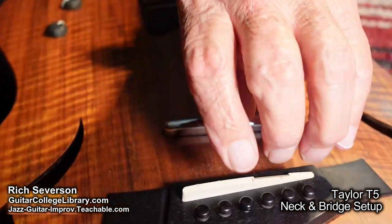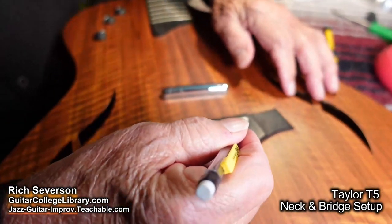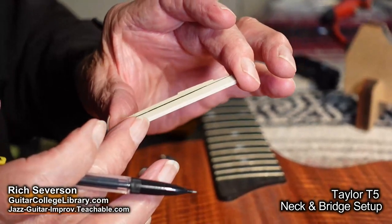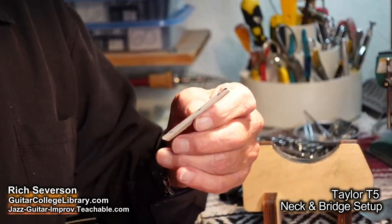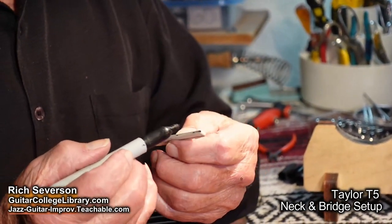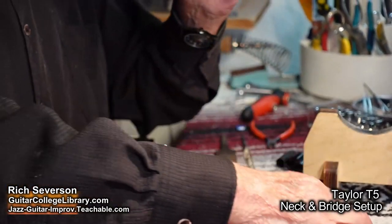So how do we do that? Very carefully, I must add. What we're going to do is we're going to find out where that — we're going to make a mark on the saddle where it's out there. So we can see that and we're going to shave off some stuff here. It was mainly high on this side. We're not going to shave this side — don't mess with that, just the underneath. Normally I might take this out to the garage and file this down with a sander, but I want to be very careful just because I don't want to have to shim it. What you do is just take a felt pen, mark it on here, so this way I can see if I've made any progress. So there it is, all black.